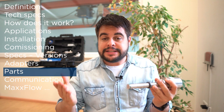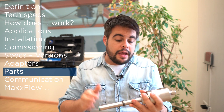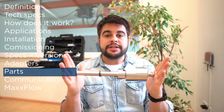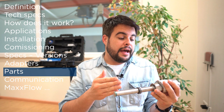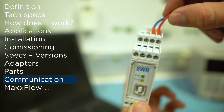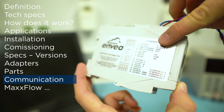If you're looking for a mass flow measurement system which requires a small inlet section, SolidFlow is a very good system to look at. It's a small sensor, easy to install, reliable, and very robust. This sensor delivers information via 4-20mA, Modbus, and even an alarm using digital output.